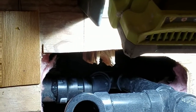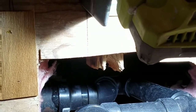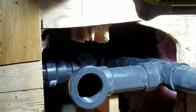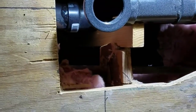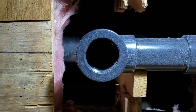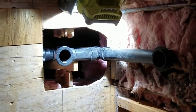This is the perfect installation for the plumbing. It was set for a shower before, so I dropped it two and a half inches with an adapter, went over to a trap, and brought it back up. We had already dry fit this, so we knew exactly how it went onto the tub. We marked that out and had the center line set. The two lines line up perfectly, so now when we put the tub back on — we put the whole marks on the paper — it will be absolutely dead nuts. Everything will line up perfectly, and the plan comes together.